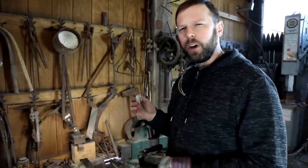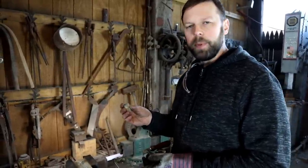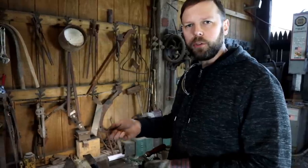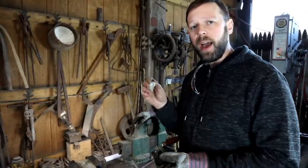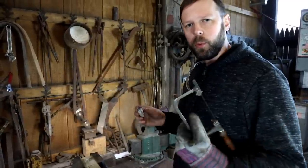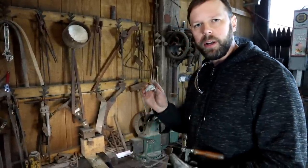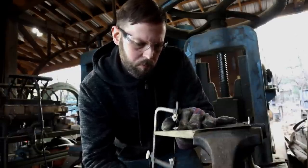Ideally, you want to use just the right amount of metal in order to do your casting. We had a little bit just in case there was overflow or spill. So you're going to have some flashing sometimes you're going to have to remove with either a file or a jeweler's saw. I've selected a jeweler's saw from the workbench area. I'm going to go ahead and get started here in cutting out the shape of our hammer.